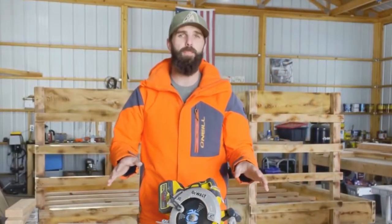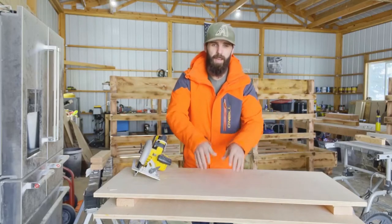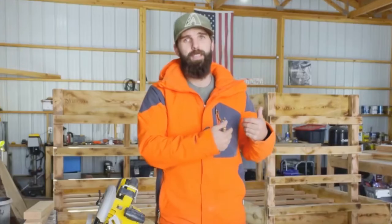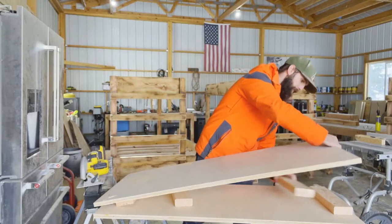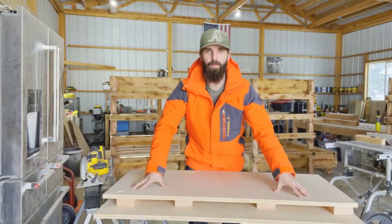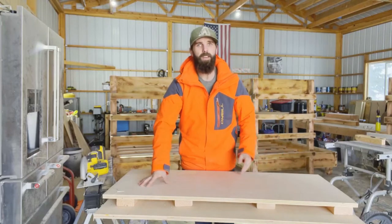The same rule applies when cutting plywood. If I want to cut a sheet down the center and I prop on the ends, there will be give in the center which will fall down, bind the blade, and kick it back. So if I want to cut in the center, I have to place my blocks in a position that gives a lot more stability — a platform on both sides that holds the sheet equally. Always remember what's going to happen to your lumber after you cut it while your blade is in the center.